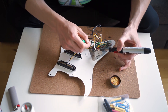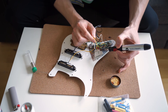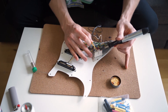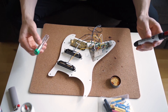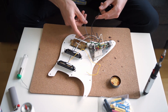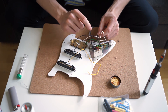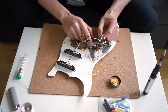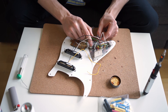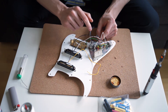An exhaust fan would be great too — I have an open door just here so I'm getting some airflow. This is also lead-free solder. I need this volume pot, I just don't need that. That's the only wire I need attached to it, so I might unsolder that blob — there are a bunch of wires soldered together and I only want one, so I'll take that blob off.